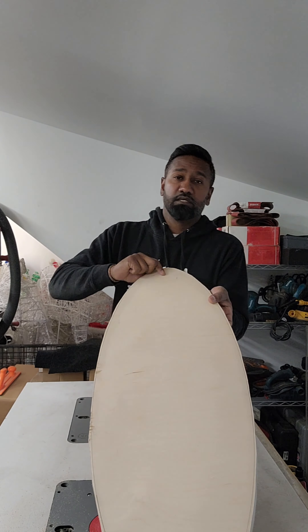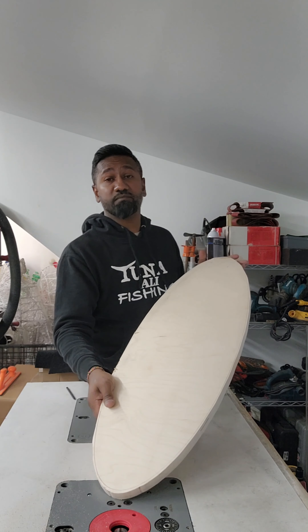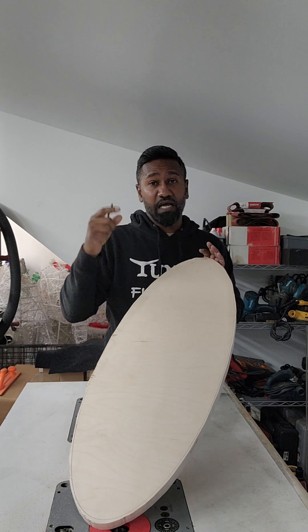We just rough cut that — doesn't have to be perfect, but you want to get really close to your line depending on the diameter of the router bit you're using. My input is you never want your router bit completely surrounded by material. I try to go where the router bit is cutting the material only on one side where you're following that template and there's no material on the other side of the bit — just saves the bit.